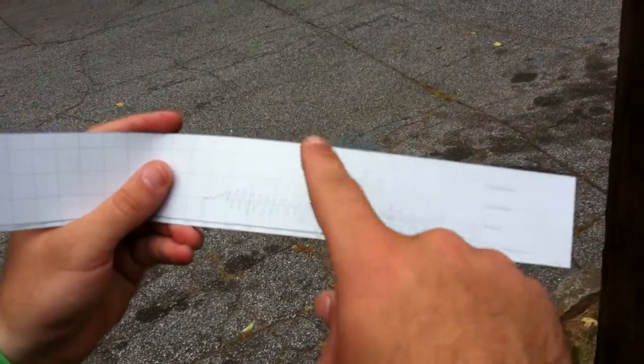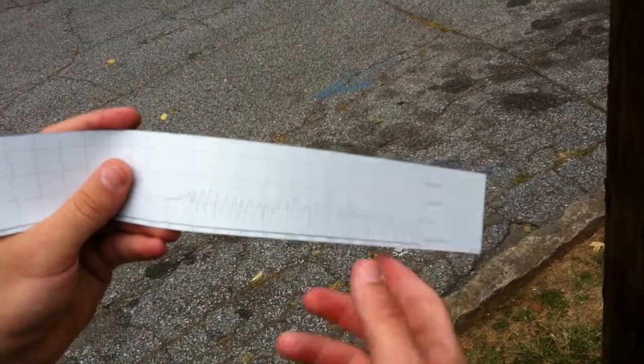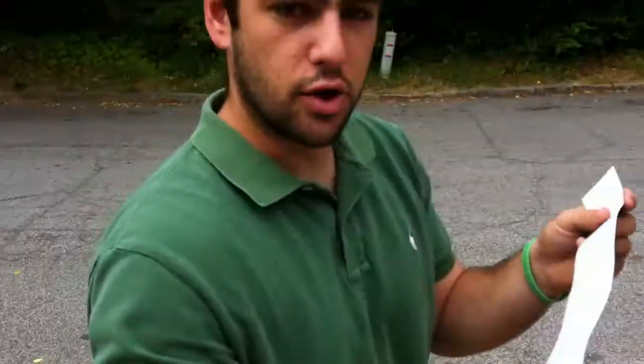As you can see from this piece, it's very consistent up and down with the rings as expected. This indicates good strong wood. Normal uniform strong points at the ring lines with less strength in between. This is normal good wood. This is a solid member. So again, this is Chris Murphy with Stability Engineering with a resistograph.